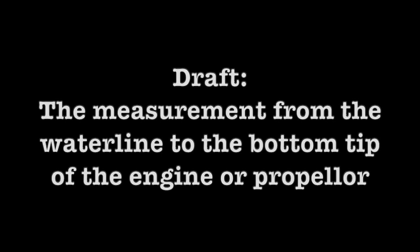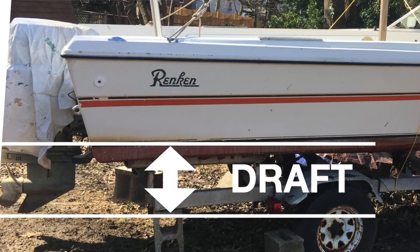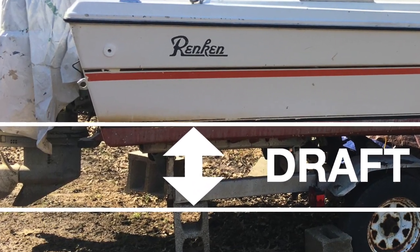What that means is that it's not just the bottom of your boat and how much of that sits in the water, but it's how far down your engine sits. If you have any kind of motor, your engine sits down in the water because the prop is turning in the water. It's important to know the draft of your particular boat. For example, my old boat was about two feet four inches — I measured from the water line down to the bottom of my outboard motor, and the very bottom edge was approximately two feet four inches.